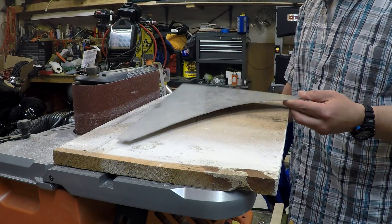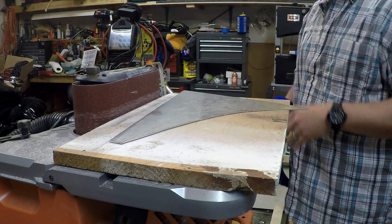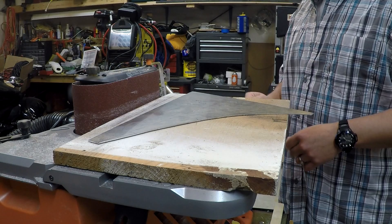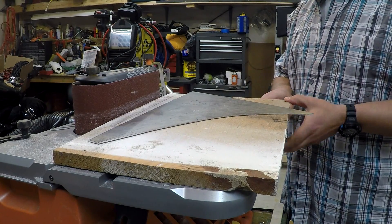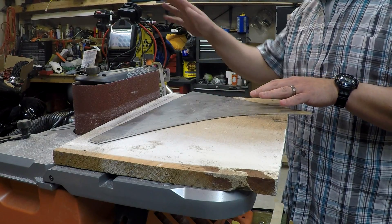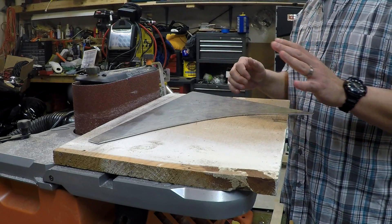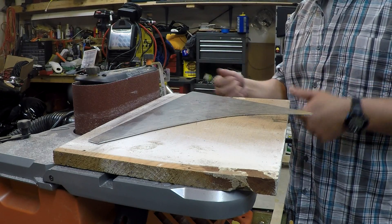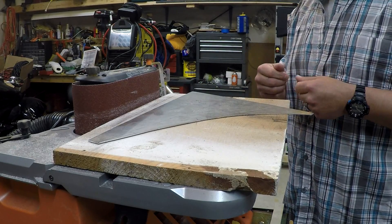The method that works pretty well for me on these larger pieces is to use my rigid belt and spindle sander combination. In a previous video on my sanding tips I noted that I like to bolt a block of wood to the platform so that I'm not scraping the soft aluminum across the metal platform of my belt sander and disc sander combo. On the bandsaw I tend to just use pieces of painter's tape instead of trying to bolt wood to it because it interferes with the way the saw works, but on these belt sanders it works pretty well.